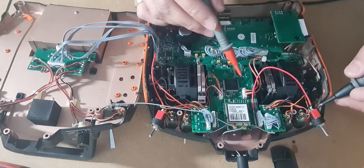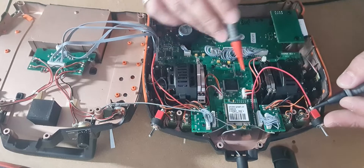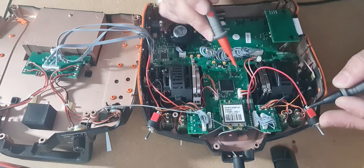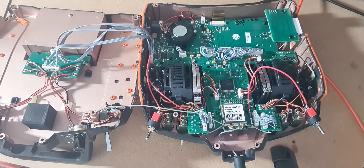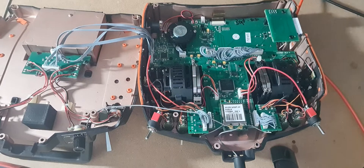After diagnosing it with the multimeter for continuity, this now works — previously it didn't. I put it all back together, plugged it in, and now the three-button switch works fine. So for anyone with similar problems, it's quite simple: get a multimeter, check for continuity, and it was just a simple solder fix — no need to send it off to Model Flight or Spektrum or anything like that. Now everything works and I'm super happy.